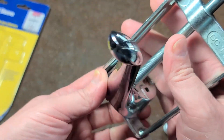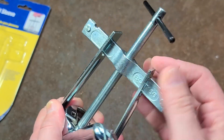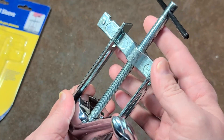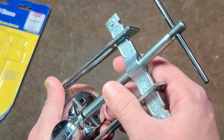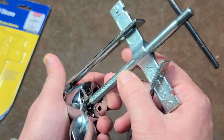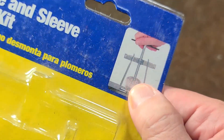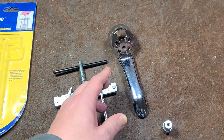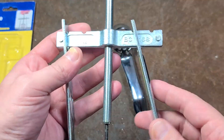Not to say that this can't do it, but anyway, you just have a simple puller. It has two little notches here that kind of keep these generally in place. It just sits along the edge, and then you just use this to twist down, and then it uses the little rod to push against the bottom of the screw hole and pop the faucet handle off. As we can see on the packaging, it'll work on standard round ones. Actually, I have the old kind of cruciform style in my bathroom, and I think that would be the one style that may not work the best on.